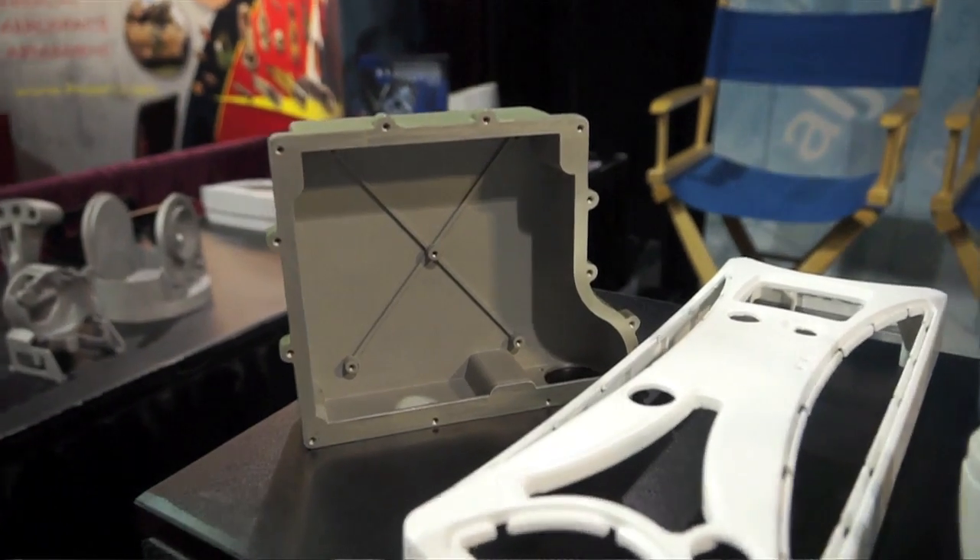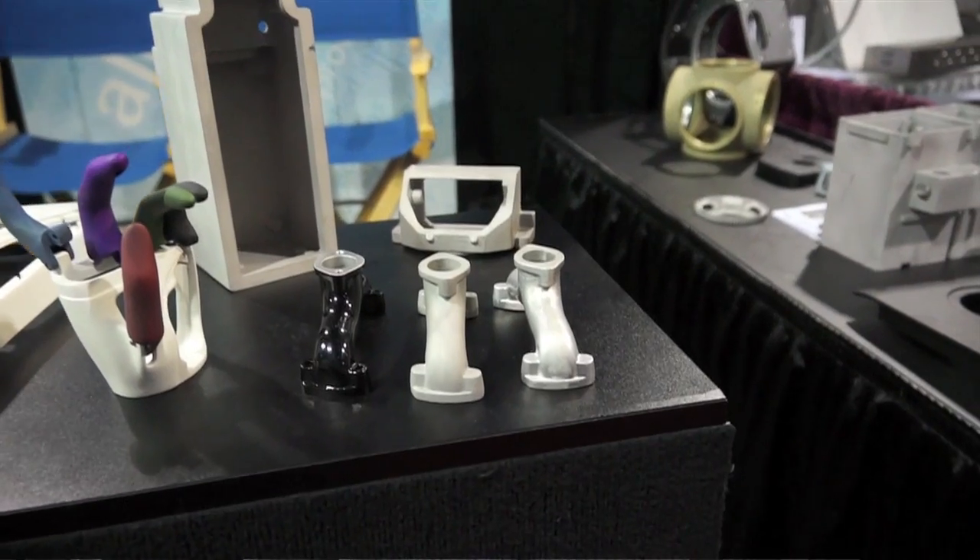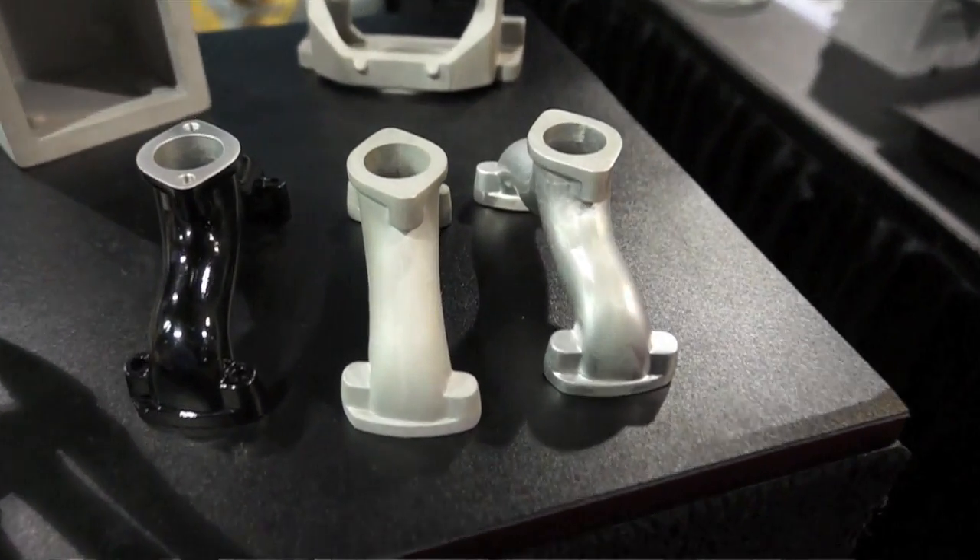It's typically less expensive than investment casting. It's rubber plaster mold, a process similar to investment casting. For a casting, very high tolerance — plus or minus 15 thousandths is basically where things start. It's one of the least expensive tooling options in the industry.